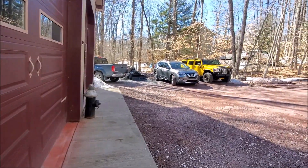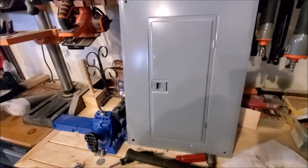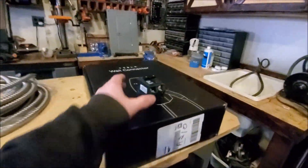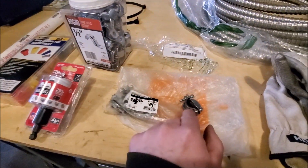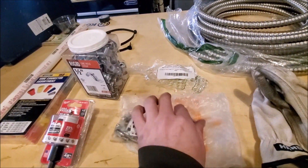Let me give you a closer view of the electrical box so you can see what you're dealing with if you've never taken the cover off. We're going to mount the 60 amp breaker in that empty spot at the bottom. You'll also need three-quarter inch clamp connectors — you mount those on top of the electrical box to hold the wire in place.